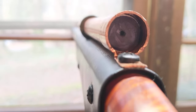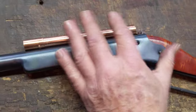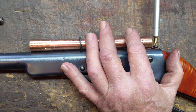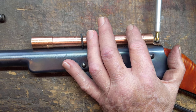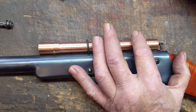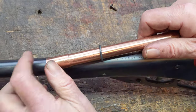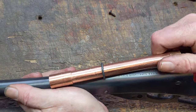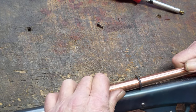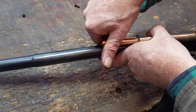I wanted to see if I could fabricate one of these that would be removable, so let me show you how this thing works. It's all half inch copper — the main body of the scope is a half inch piece of copper pipe, and the two end pieces are half inch copper pipe couplers. This thing goes together without having to solder anything; it's a press fit affair. So you pull the top mount screw off and give it a slight twist to the left or right and work it a little bit.